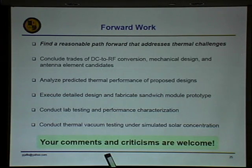Yeah, I mean, these are great questions, right? Because we have pretty limited resources, we had to bite off a small manageable piece. It's very easy with the space solar power implementations to chase yourself, because by changing one parameter here, you radically alter the impact of another parameter. So we said, all right, we don't have the time or resources to do a full-on system design, which ultimately would need to be done for a real system. Let's take a look at this one possible component, look at the limitations, define the boundaries, so that when you do go to design that ultimate system, you're not trying to do something that ends up being crazy, like saying, oh, we'll get 100 suns so that we can reduce our PV area to some tiny amount.